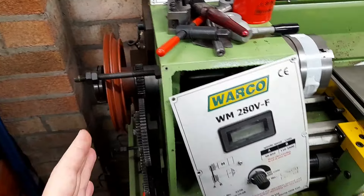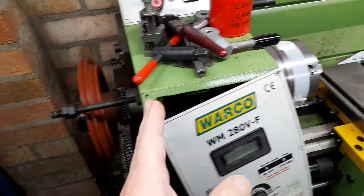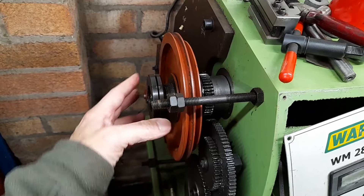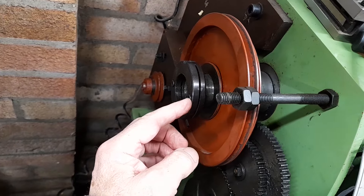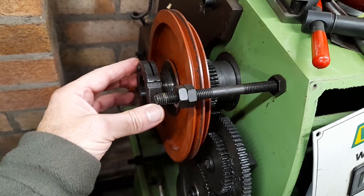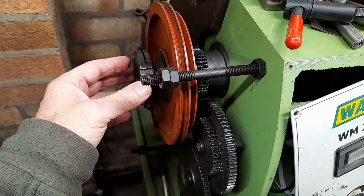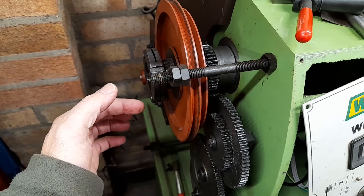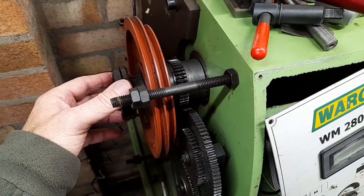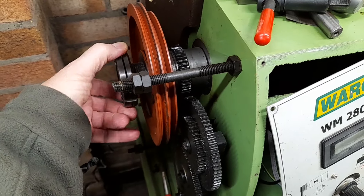The main bearings are on the shaft — there's a bearing there and a bearing there, with the drive gears released. On the end there are a couple of screws for clamping, and as part of the maintenance you loosen those screws, then a C-spanner goes on to crank that up and pull tension onto the bearings. However, I tried that a while ago and couldn't get it to move to tighten up. As part of this refurbishment I tried again — undid the screws, loosened it, and got the collar off.